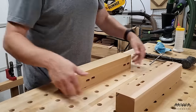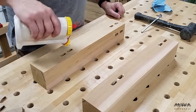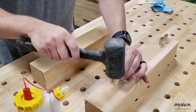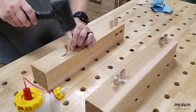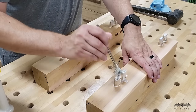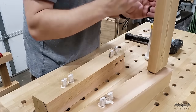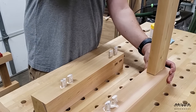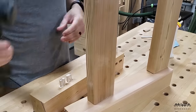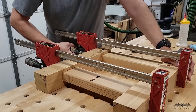Now to begin assembly, I'm careful to orient my legs correctly. I then apply glue to each mortise. I'm using Titebond III for this build because of its higher water resistance since this is going to live outdoors. And with a mallet, I tap in each of the eight dominoes — tapping in dominoes is so satisfying. Then I give each domino a little hat of glue spread all over. Now I pop on the short apron and stretcher, assembling the sides of the table first. A few taps with the mallet will get everything seated, and the clamps are going to take care of the rest. Finally, I add the opposite leg and tap it into place, then put both table sides in the clamps and make sure all my joints are tight.